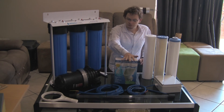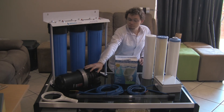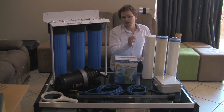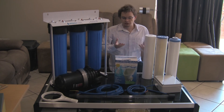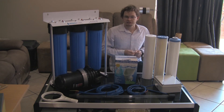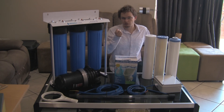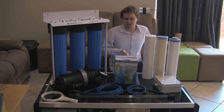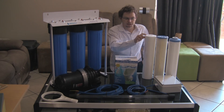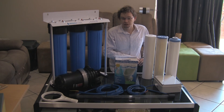So from the tank with the UV you then run through a pump to pressurize the line. The first step would be the washable disk filter, which is to catch dirt particles. We recommend this especially if the Superhead isn't set up perfectly — you could get a lot of fine dust into the water, and without this you can easily use up a set of filters within a day or two if the water is quite dusty.